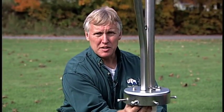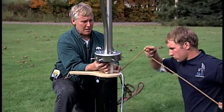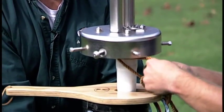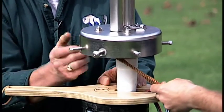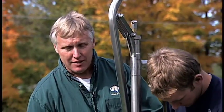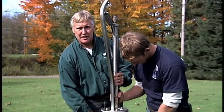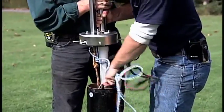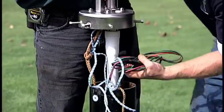Tie both safety ropes — the hand pump rope and the electric submersible pump rope — to the quarter-inch eye bolt underneath the well cap. With ropes secured, lift the weight of the pump, remove the paddle, and have a helper push all the wires and ropes back down inside the casing. Do this step fairly quickly; with more pipe lengths it gets heavier.